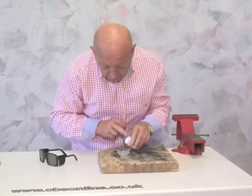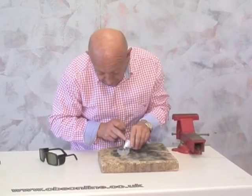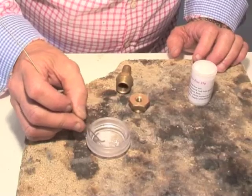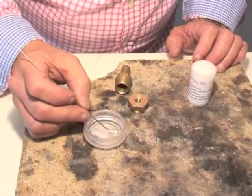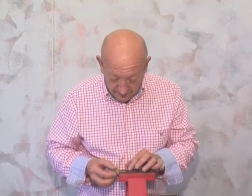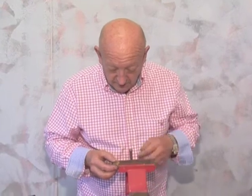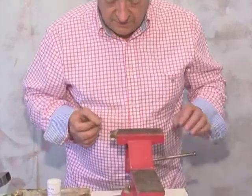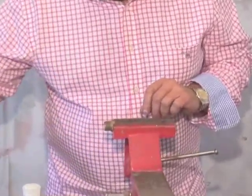We're going to make a very thin paste with a little bit of water and a little bit of flux. Silver soldering relies on having two pretty flat surfaces together — it won't gap fill. So we're going to cannibalize this half-inch union by sawing off the thread that we don't want and then filing the surface flat.